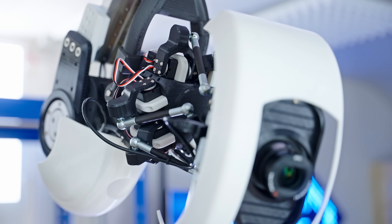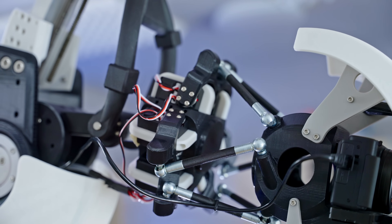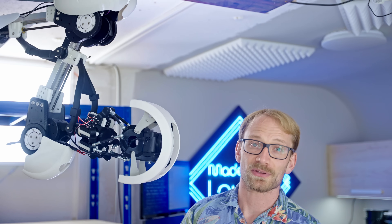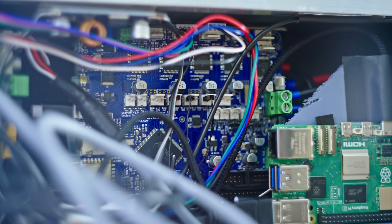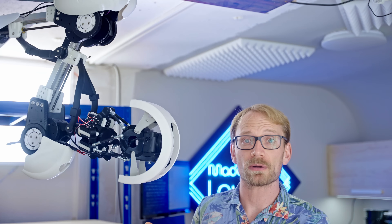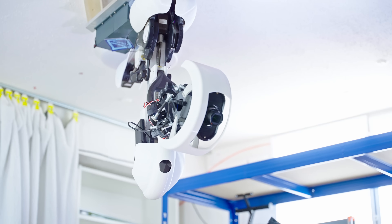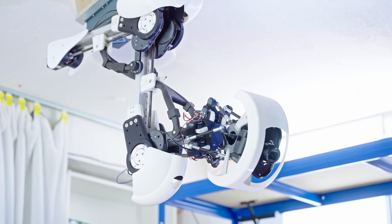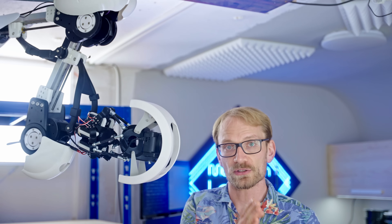So the servos in the head handle motion directly — each one has its own motion controller that you can talk to over serial. And the three stepper base axes? Well, they think they're a 3D printer. I see stepper motors, I use a 3D printer mainboard — in this case a Duet Wi-Fi, which is actually pretty useful. The Reprap firmware has a constant move-time mode where you just tell it here's the G-code you want to run, do what you can to finish it in, say, 15 milliseconds. It also does move chaining, where it doesn't completely come to a full stop between each of these segments.